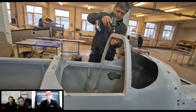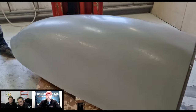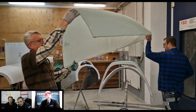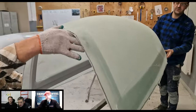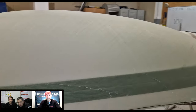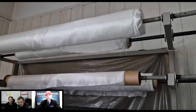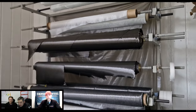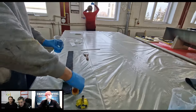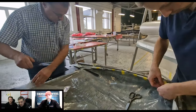Okay. And the process that starts out, do you use a foam and then a CNC to make the mold, or what does the initial shape look like before you pull a mold off of that? The general shape of the mold was taken from 3D, and it was milled on a 3D milling machine as a positive element. And then we take the molds from this positive element. Also, after this, we had to add some small changes. And of course, we had to add all these fake rivets and fake screws, which are originally on the surface of the Mustang. So this was, let's say, a mixed process of producing these molds.